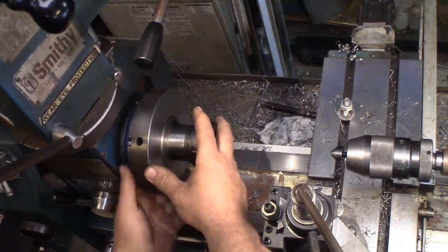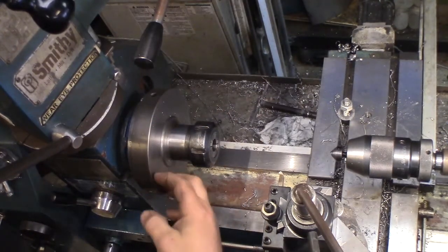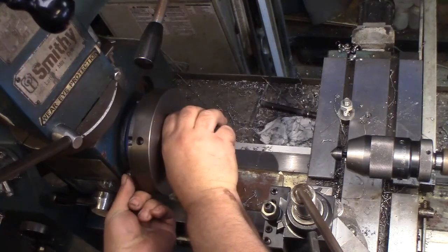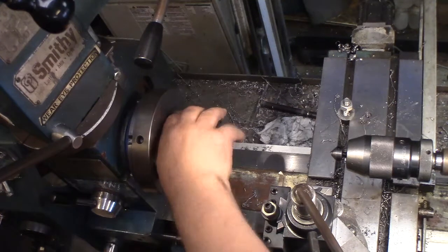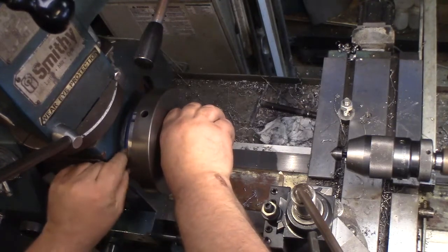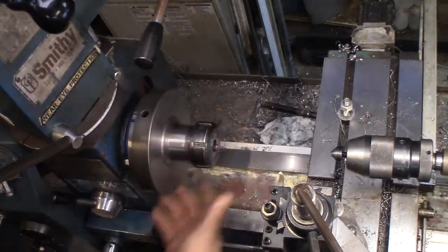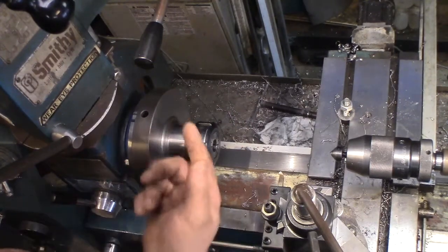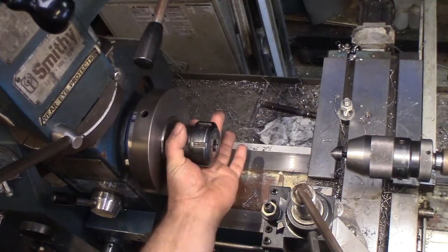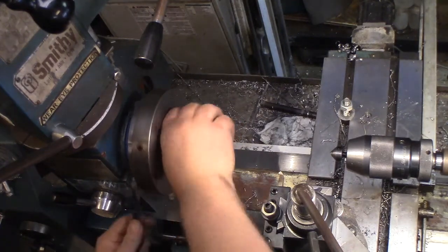One of my six viewers keeps asking about these. And this was turned down from a piece of barbell, I'm pretty sure, because I didn't have any real steel that thick. Cast iron's really the way you want to go, anyway, since the crystalline structure tends to dampen vibrations and ringing compared to aluminum or straight steel. And one of the first projects I did, I figured machine parts are made out of cast iron, and that's what I'd use. So yeah, I took a smaller dumbbell that was just small enough where I could put it into my largest chuck with the jaws reversed, and I made up this hub plate here, and then bored it, and then pressed in a made-up collet nut or a collet body, and it's been fantastic ever since it was done.